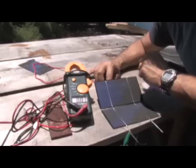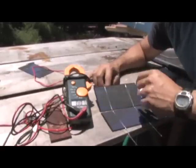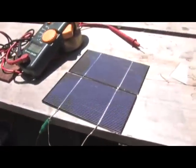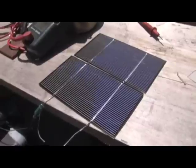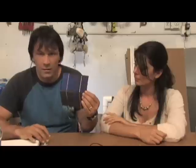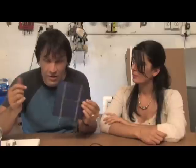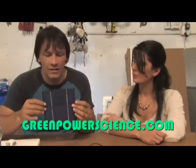In order to get something to charge 12-volt batteries, you're going to have to do this 36 times total — you need 36 of them to get to the 18 volts that you need. This is a pretty tedious process. Doing it this way comes out to about $2 a watt, maybe a little bit less than that. As you can see, these are very fragile — they break easily, so you've got to encase them really well. You need to put a glass cover over them and seal this so moisture doesn't get in there. There's really a lot to the DIY process with this.